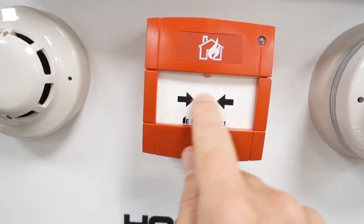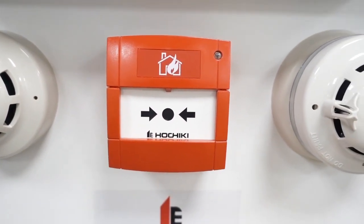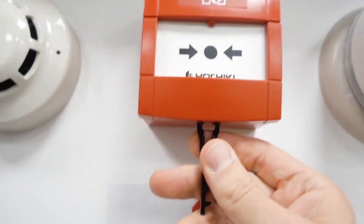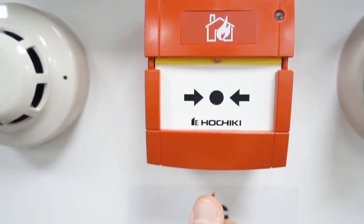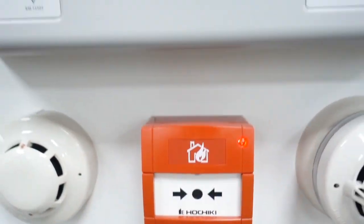So here we do our test again — it's a plastic break-glass so you don't have to worry about replacing glass or anything like that, it's all plastic. So you put the prong in like that, you shove it up, and then with your thumb you pull down. You take the key out, the light comes on, and put it back together.